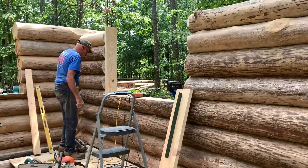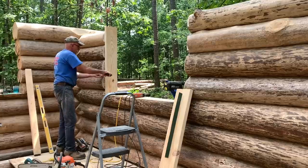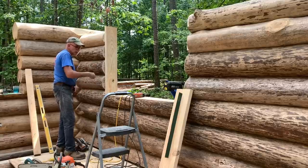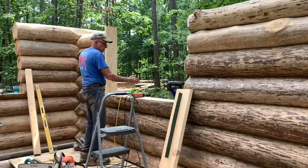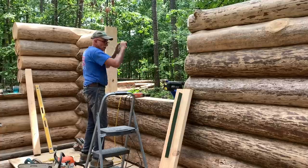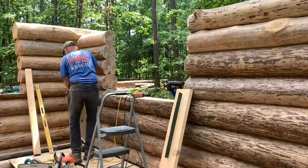And then we'll use a 3-inch trim we're using here. Be 3 inches wide, about 2 inches thick. We'll do the same thing over there. And we got two 30-and-a-quarter-inch windows, and then I'll have 4 inches between them. And we'll just trim that out. Anyway, it's working pretty good.